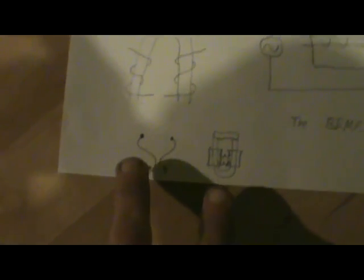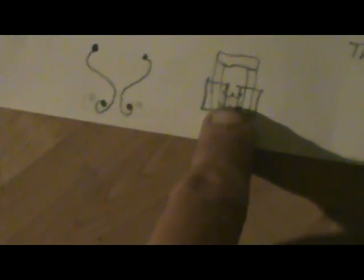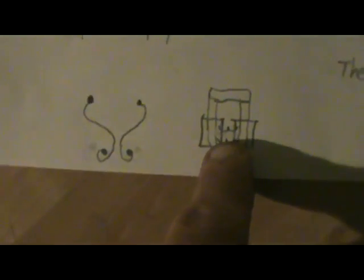And by the way, here you go. This is what I was going to say before. Ed showed us right from the start the covers of his book, two of his books. This is on the one cover, and he's showing us how the two coils are wound in opposite directions, right? And actually, he has connections on either end. But he goes a step further, and in his other book, he doesn't show the winding directions, but he shows that these ends are connected and these ends are connected. And actually, with the little upward point there, it would suggest that he's implying that's where you tap it, just like we were talking about here.